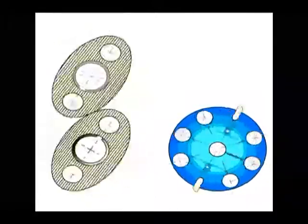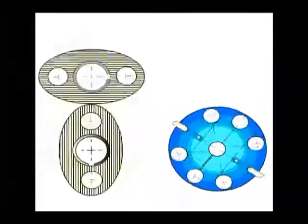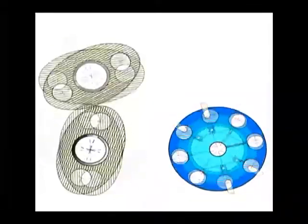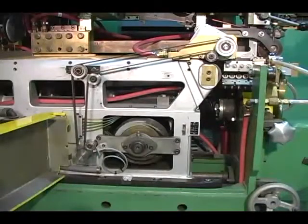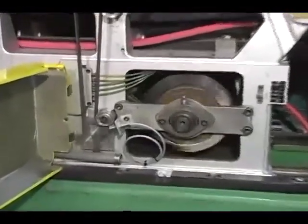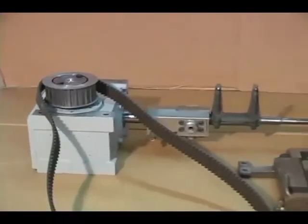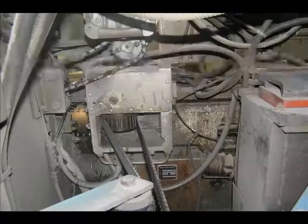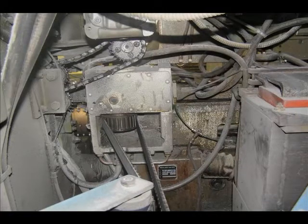Once the squaring wheel with its rotary gearbox is installed, the squaring assembly is no longer the bottleneck of the machine's mechanical capability. A second advantage of the squaring wheel gearbox is direct drive from the transport chain, which is achieved by means of a timing belt. This eliminates the Ferguson gearbox and Ferguson gearbox clutch, two more items which required maintenance and had a constant potential for failure.